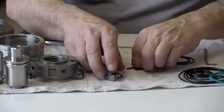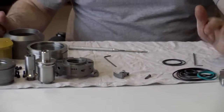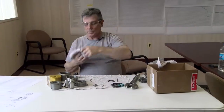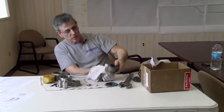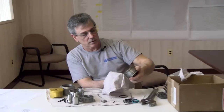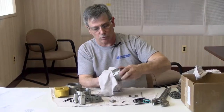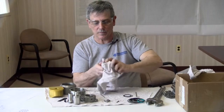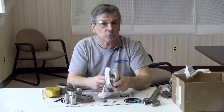That's pretty much the extent of taking apart and breaking down this adapter. Now, the really bad ones I could take to a cleaning tank — you can see a little bit of residue and a little bit of dirt and some dust from running and filling reservoirs with coolant. I'll just wipe all that off, but you normally take it to a cleaning tank and clean it with some mineral spirits. While I'm wiping them down, I'm checking with my fingers for any burrs — to see if there's any debris or anything sticking up, sliding and moving — to see if there's any wear.